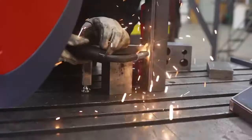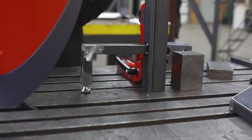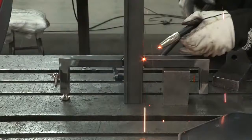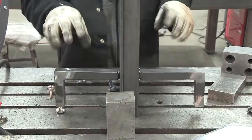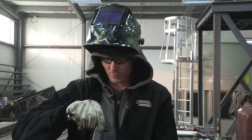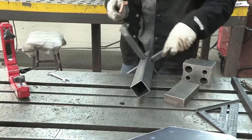We'll do our last one on this side and then the angle should just stand on its own. We've got everything all set now — everything's tacked together. We're going to turn it on its side and do our final weld so we can run these down. We want to brush these off a little bit just to get rid of any extra carbon or smoke that's on there that would create porosity in the weld — we'll just quickly clean these up.